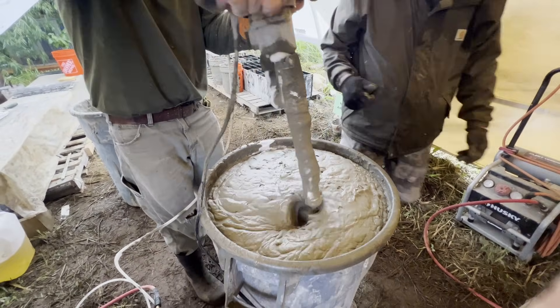A tip: if you want to check your mix, check the density of the wet AirCrete at the top and the bottom. Take a quart bucket, check the density, carry the bucket over to fill your forms, and before you've completely emptied it get another sample and check that density. They should be very similar — if the bottom is a lot heavier than the top, you didn't get a good mix. That's a good thing to verify when you're first doing this. Then just repeat: dump more water into the bucket, dump in another bag, and repeat.